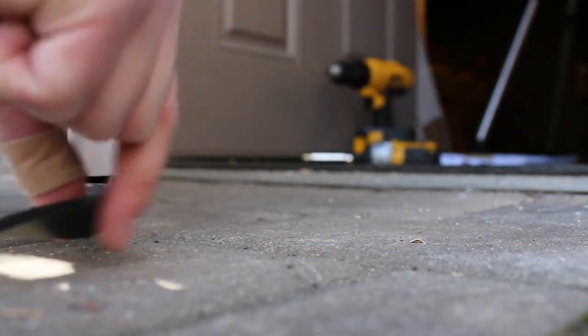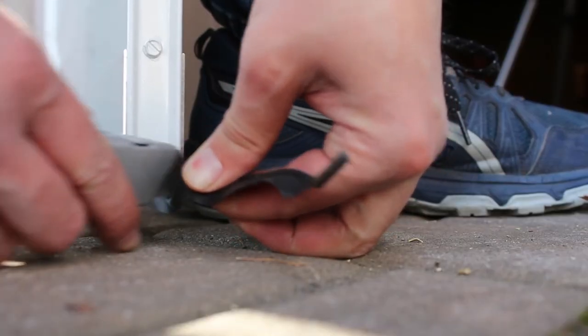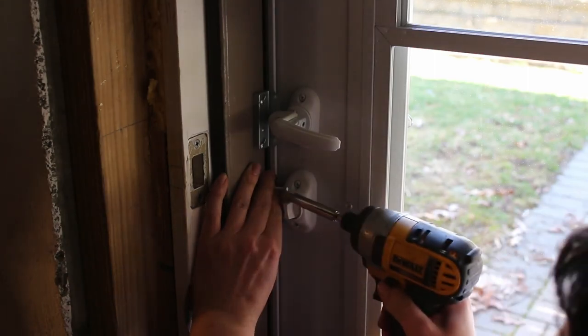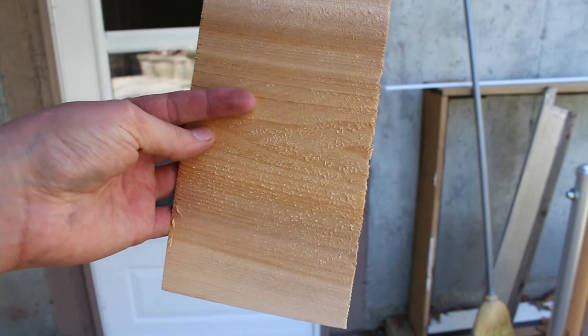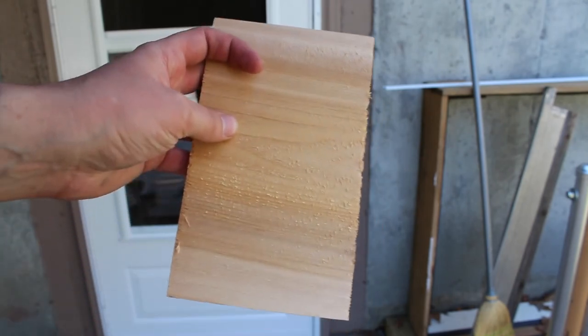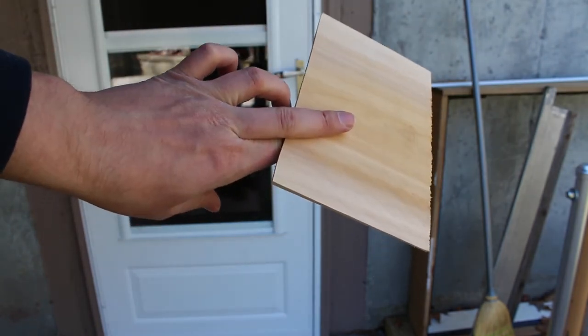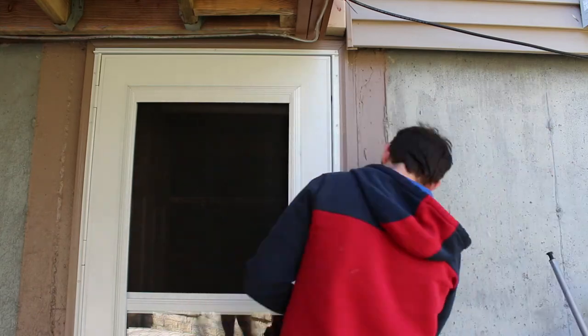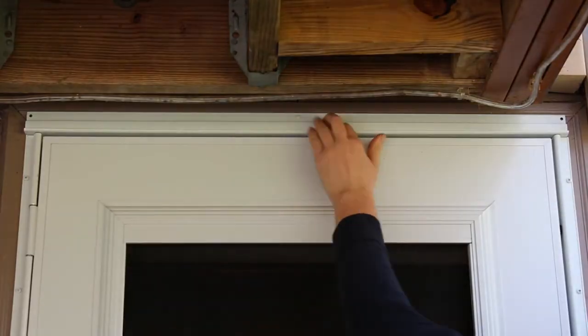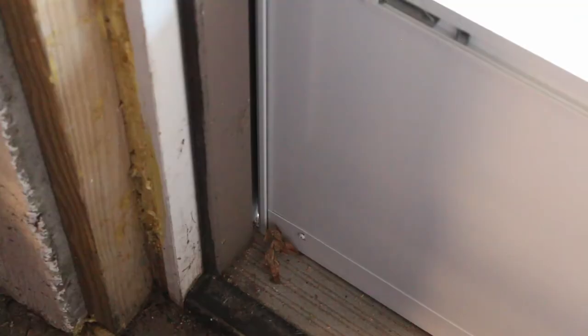There's a gap that we'll address now. Because our door frame is probably not straight, we have a little bit of gap at the top. I'm going to take this extra cedar shingle, score it, and wedge it at the top of the frame, then zip it back down — and that really fixed the gap, giving us a nice tight seal all the way around the door. Now install the lower bottom door seal and cut off the remaining excess with the utility blade. You can also install the striker for the door lock. Finally, I went and installed the rain cap with the remaining screws and used a little silicone to seal any gaps in the door frame. If you have any questions, feel free to ask and please subscribe. Thank you.